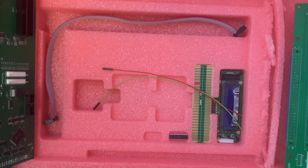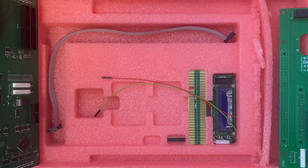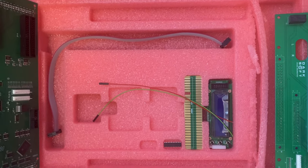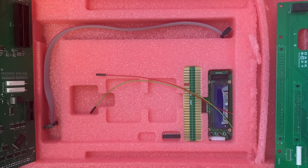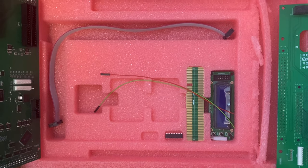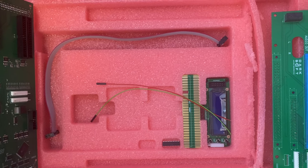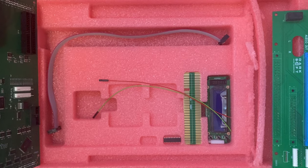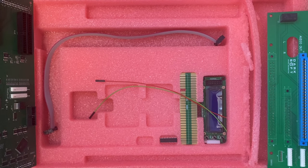Underneath we've got an LCD controller for selecting which game is going to play, a fingerboard that connects to the filter board, a PAL chip that needs to be swapped out, and a ribbon cable for connecting the LCD selector to the multi-board.